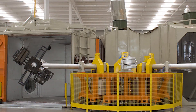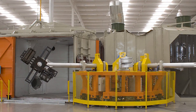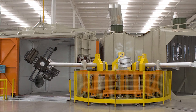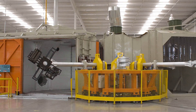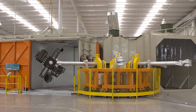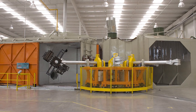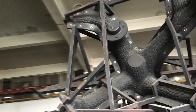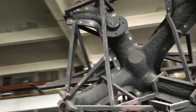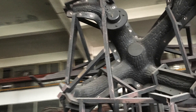Rotational molding machines are made in a wide range of sizes. Spindles are mounted on a rotational axis which provides a uniform coating of the plastic inside each mold. Molds are usually fabricated from welded sheets, cast, or cut from aluminum blocks with CNC machines. The fabrication method is often driven by part size and complexity, with most intricate parts likely made from cast and CNC tooling.